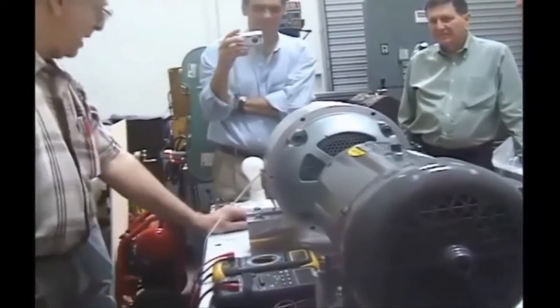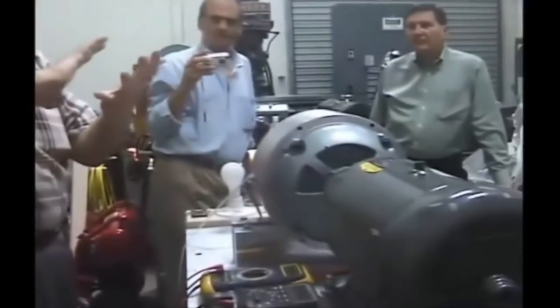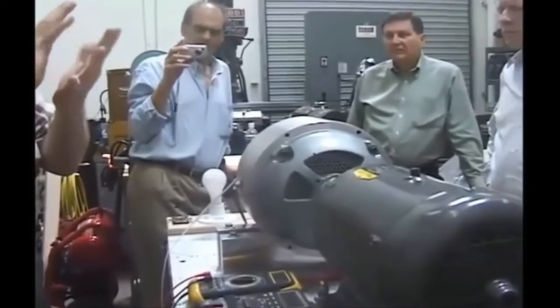All right, I'll bring it up again, and I'll show you that thing, because when I pulse this switch, take the load off and put it back, the position of the rotor will have a chance to change before that magnetic field reestablishes, and it will temporarily convert this into a motor, but it takes off, and I have to kill it right away.